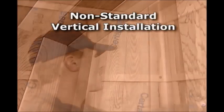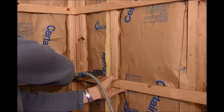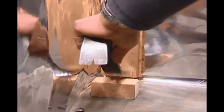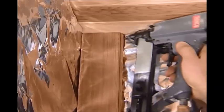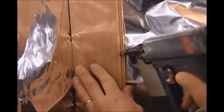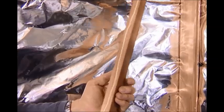The standard pre-cut package is meant to be installed horizontally. However, if an optional vertical installation was ordered, apply horizontal nailers to the studs at 16-inch spacing or install horizontal blocking in the walls prior to foil installation, so that the boards can be applied vertically. Then, install the foil and start the first vertical board at the back corner of the room. Use a pry bar and block as a lever at the floor to make a tight fit at the ceiling. Nail the board in place. Next, rip off the groove from the next wall board, apply a bead of glue to the board, and nail to the wall.